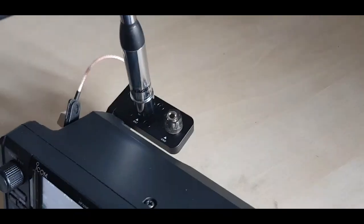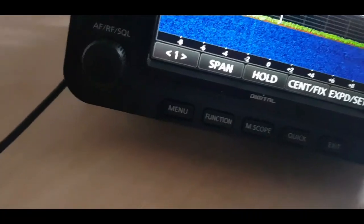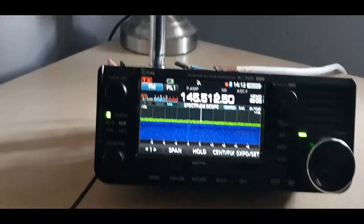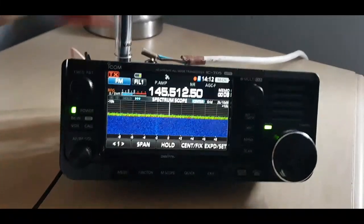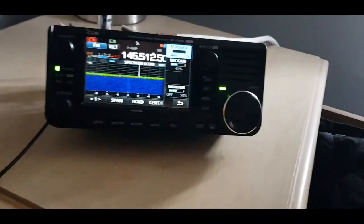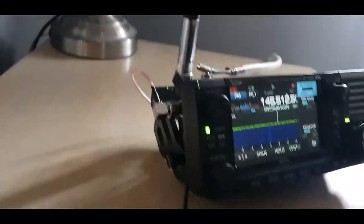And we are near a lot of stuff here. See if I've got an earthing cable lying around. I used to have some earthing here. Right, I've got this thing which is an earth. Let's just see if it makes any difference. Nah. So yeah, it's badly earthed and badly SWR, so it needs to be tuned to be resonant. I bet if I turn the power right down to virtually nothing, probably be alright. No, definitely not. So not a great SWR at the moment. M0FXB playing around with its Nagoya.